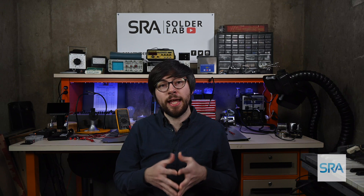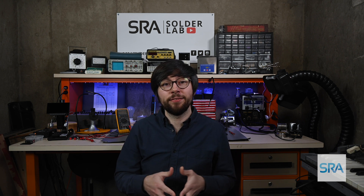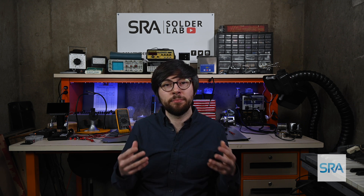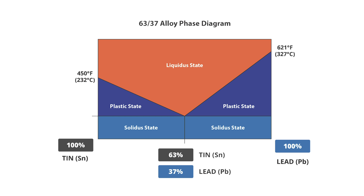So why does solder use lead anyway? The reason that soldering is so synonymous with lead is because it has been used in the formulation of solder since the beginning of time. Chemists discovered that the alloy of tin mixed with lead resulted in a much lower melting temp than the metals alone. Tin melts at 450°F (232°C) and lead melts at 621°F (327°C), but when combined into an alloy of 63% tin and 37% lead, the melting point drops dramatically down to 361°F (183°C) — a temperature low enough for a soldering iron to handle, where higher temperatures would require a torch.